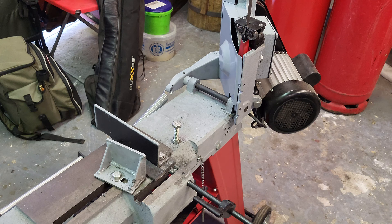But even though it has its issues, this unit is such an improvement over an angle grinder — no noise, no grinding dust everywhere, no need for PPE unless maybe glasses. You don't burn your pieces, and you can easily cut out more or less precise shapes out of your steel stock, which just isn't possible with an abrasive disc without losing a lot of material. Since we work with Damascus quite a lot, we like to keep as much of the leftovers as possible, because you can use them to make guards or decorative pieces on knives.